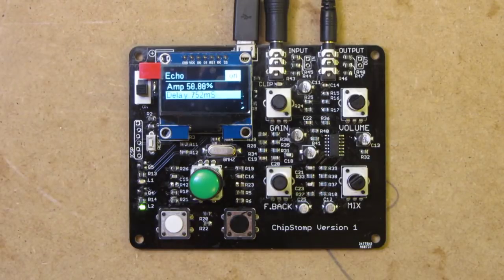The input is a 10-bit built-in analog-to-digital converter within the PIC, running at 44 kilohertz. The output uses two 8-bit pulse-width modulation signals, mixed together using resistors to produce a single 16-bit signal, which is filtered through the op-amp producing an analog output. Internally everything is handled as 32-bit, because the PIC being a 32-bit processor handles that nice and easily, giving loads of headroom to handle things like clipping. We've got 32 kilobytes of RAM to play with and 128 kilobytes of program memory — I've used about half at most, mostly fonts and things for driving the screen.